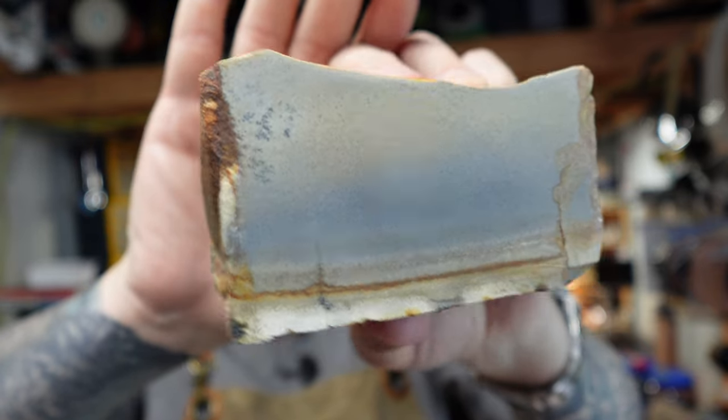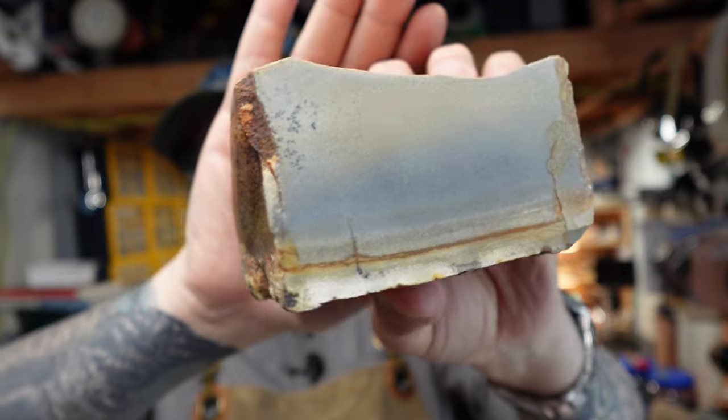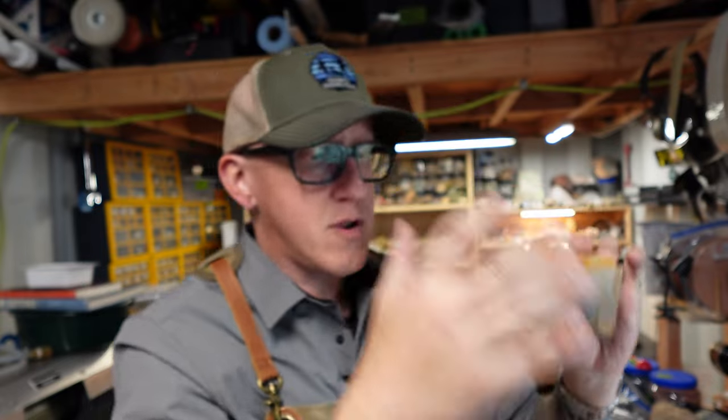The question inevitably arises often when somebody purchases a slab saw: what do you put in it? The saw behind me is stainless steel and you can put water in it. When you're cutting by hand with water, you really should have either a plastic saw, ones made out of stainless steel, or ones made out of aluminum, because things have a tendency to rust. We're talking about big saws — slab saws — and almost all the time slab saws are made of steel. They might be painted on the inside, but they're steel and they can rust, so we don't put water in our slab saws. We want nice smooth, buttery cuts coming off that slab saw.